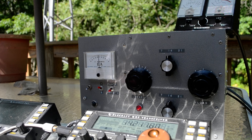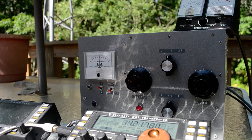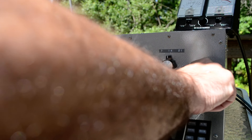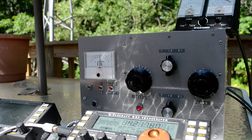So I peak it in the negative, then I'll put this over in the multiply-times-10 position and key it up again. Let's put it in the plate position and see if I can dip that. Yep — and it looks like about 250 milliamps.